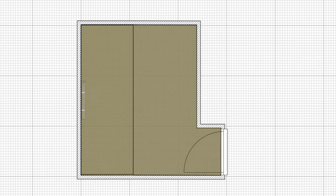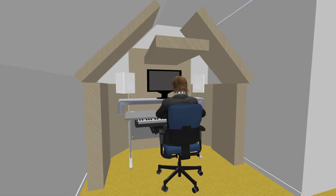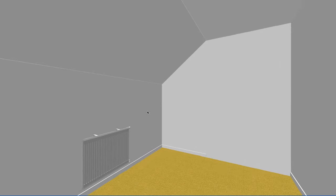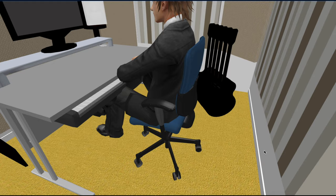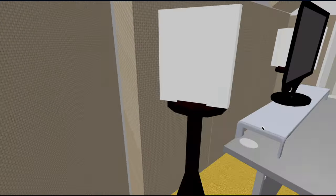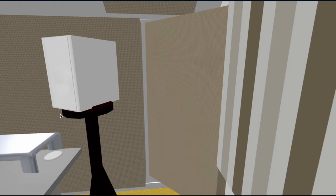So after finding the space, one of the first things I had to do was design how I'm going to fit everything in and see what would acoustically work. I tried out a few different layouts. The traditional wisdom is to go long ways through a small room, but the room has a sloped wall, so having it going that way would mean a stereo imbalance. I decided it would be best to face the slope, which gives the most symmetrical setup. I want to point out the fantastic work of Jesko over at Acoustic Insider — I'll link to his channel — pretty much all of the acoustic side of this build is based on his advice. I bought his Build a Better Bass Trap course. I didn't end up building them myself, but the methodology of placing the bass traps was invaluable.